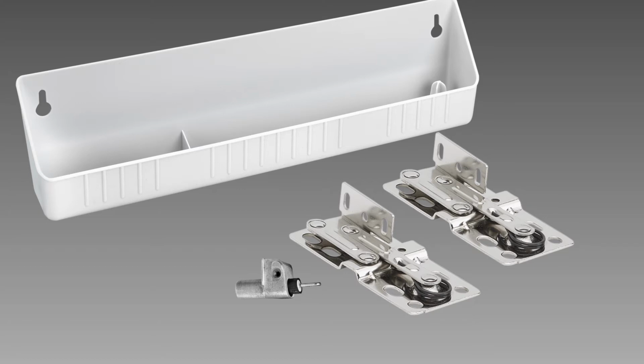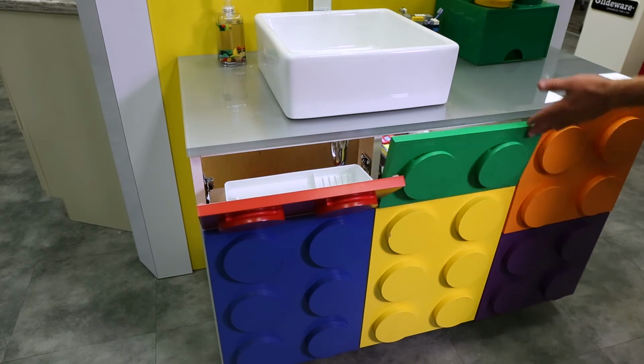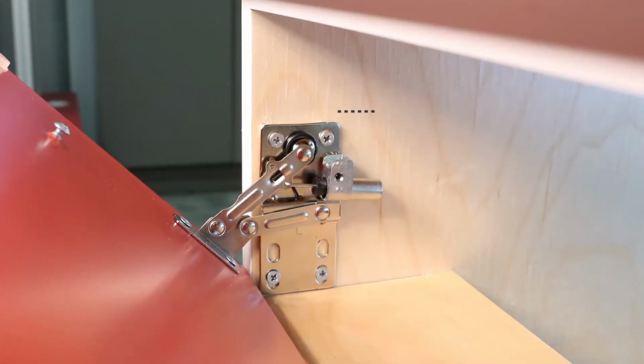The soft close dampeners have been engineered with enough force where only 1 dampener is required per set of hinges. The type of sink base cabinet you have will also determine how many hinges you will use. Measure to make sure you have at least 3 inches of clearance on only one side of the opening, and that will be the side you mount your soft close dampener.